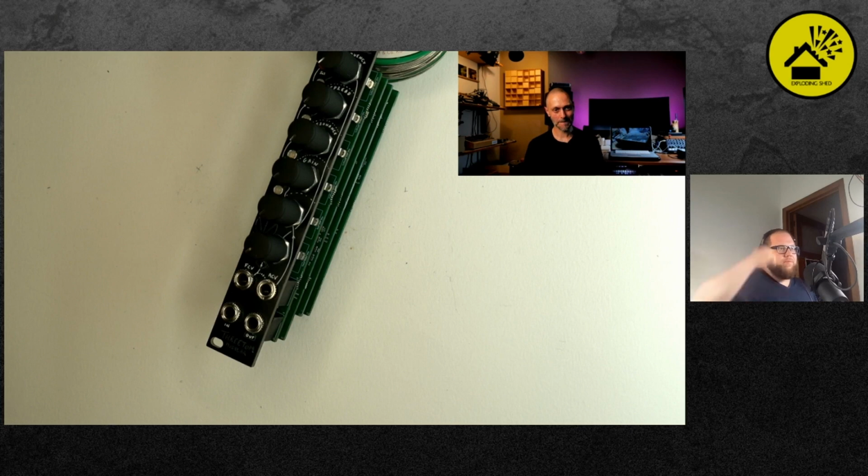A good tip if you really want to sound clean: put an amp after the output of the MS-20. It gets clean, but you can get it even cleaner because the gain is input gain, not output gain. If you have really low input gain and then give some extra gain at the output, because the output will be weak, you can get an even cleaner sound. Steve up here is a great fan of that sound. Yeah, that's what I noticed. When you turn the gain knob below 12 o'clock, it gets very silent. Okay, now that clears it up.